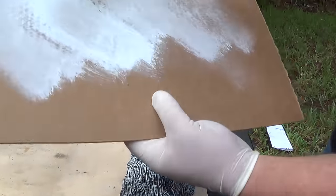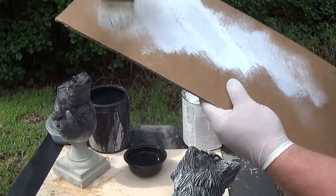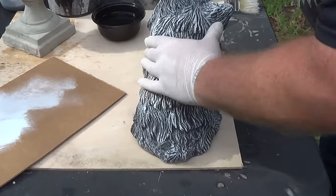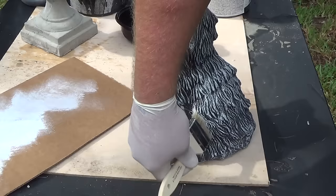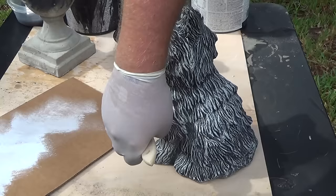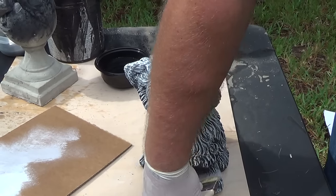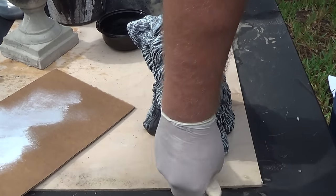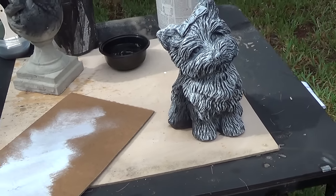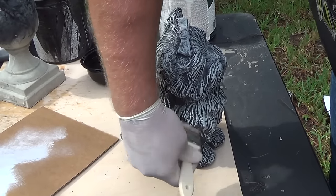You can see how fast this is — I'm actually doing it slow for you folks. Generally a piece like that would take me all of 20 to 30 seconds to antique totally the way I do it at the shop. Very little on the brush, just going back and forth, not applying much pressure — just dusting it. Pretend it's dusty and you want to dust it off. And you see just how easy it is — it basically paints itself. That is the easiest, quickest way to get this two-tone effect using paint, and that's the dry brush technique.